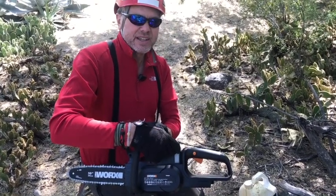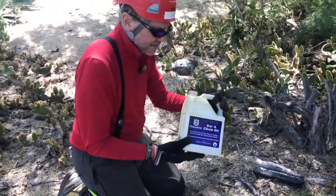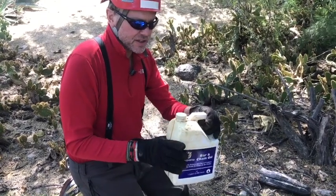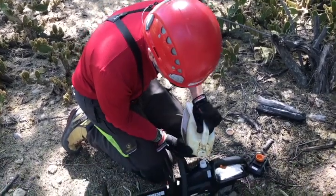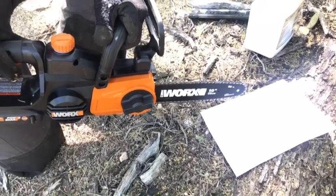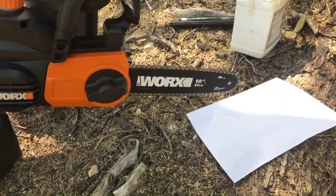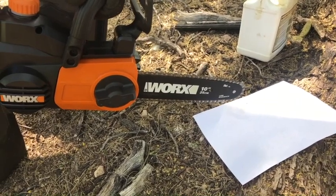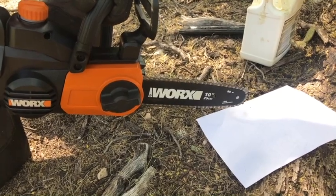It's really important that you keep track of your oil reservoir and never run it empty while using the saw. I'm going to put some bar and chain oil in here — I actually like the premium Husqvarna bar and chain oil, I've used it for years. To make sure the automatic oiling is working, I'll start the chainsaw and use a piece of white paper — after a few seconds you should be able to see the oil spraying onto it.